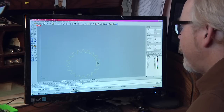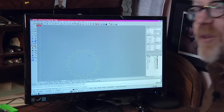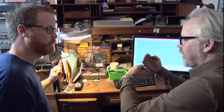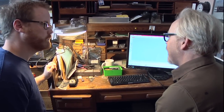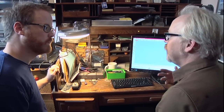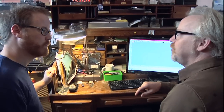And then when you're doing the other gear that lines up with this, how do you make sure that you have the right teeth to fit in that? If you are actually doing a real gear, this is not real gear design. If you're doing real gear design, there's a lot of rules to follow, because every plane on a gear is designed to mesh with every plane on its mating teeth. Mm-hmm. So actually for the orrery that I'm building, I am working with some pre-designed gear shapes, which I'm holding to. You have to know that if the tooth is this tall and this long and this wide, if you want 19 teeth, your circle is this big.